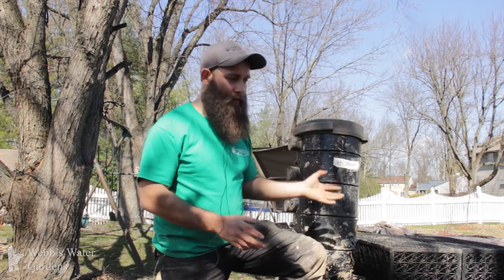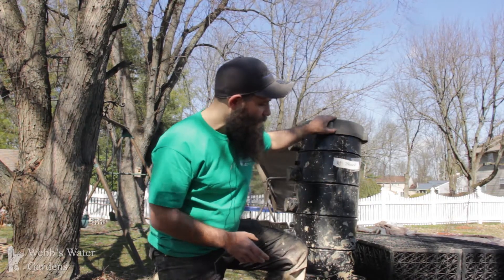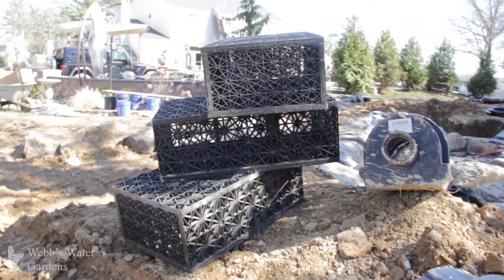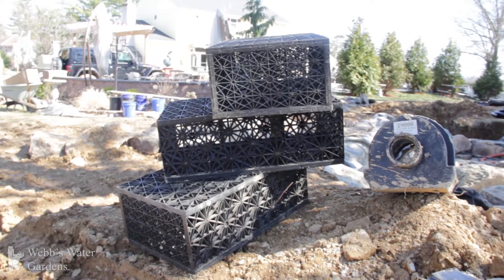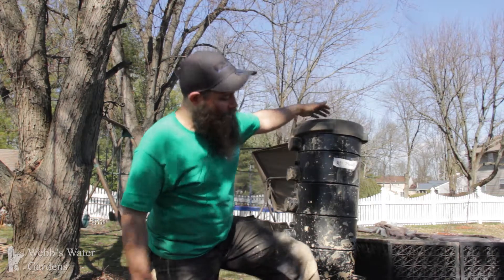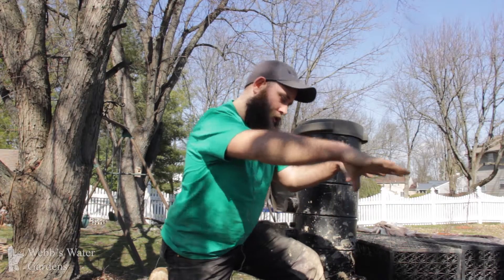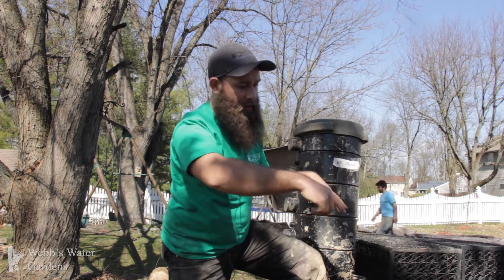This concept is a little different. For the wetland filter, we're going to have an Aquascape snorkel vault, a centipede module also from Aquascape that connects into the vault, and aqua blocks. Instead of your pond tubing sending water up into a waterfall box, we're going to send water into this centipede module, which will sit deeper into the ground than the rest of the floor, as you'll see in our excavation process.